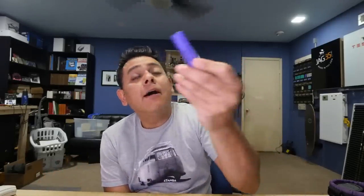Typically, the data sheets say not to exceed 75 to 80 degrees Celsius. Really? So they say it's somewhat okay. I'm like, that's hot, man. That's the temp they typically hit in their continuous current rating. Yeah, so I saw this one hit 100 degrees Celsius on a 10 amp load, and I was like, no, that's not a 10 amp. At least not these, right?